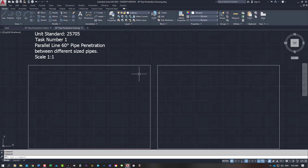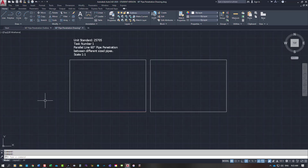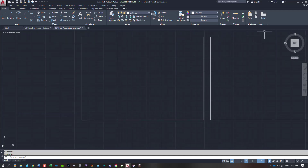On the next sheet I've got two boxes exactly 421 by 297, which is an A3 sheet of paper. This drawing needs to be done at a scale of one to one. I'm going to come up from the base of the sheet 10 millimeters, offset it up 10 mil, and offset in 10 from there.